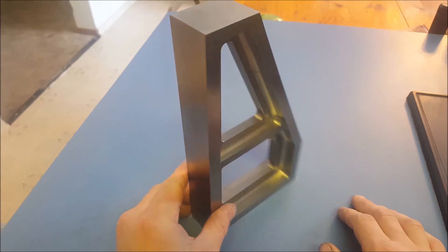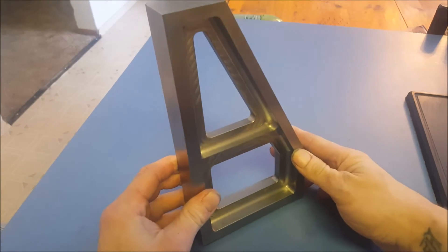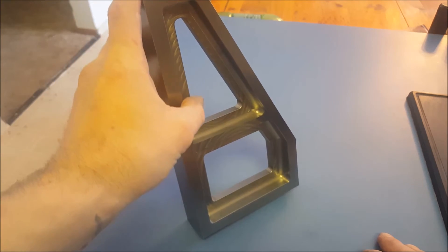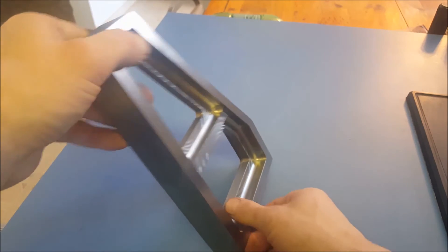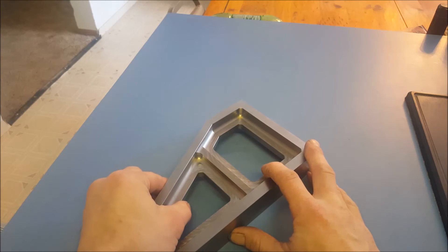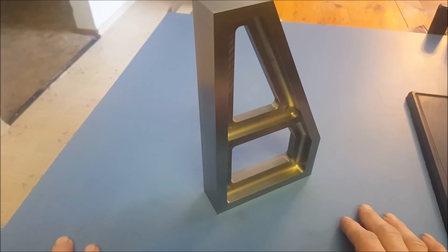I don't know, I might change my mind later. The machining turned out really well. I actually brought it to work with me to try the clean cycle on the oven to do a quick down and dirty heat treat stress relief on it. It moved significantly after all that machining was done. There's quite a bit of material removed out of there. And when I went to grind in this front face and the bottom face, I clamped it to a cube in this fashion and it actually lifted these previously ground faces off the plate. It'll get heat treated — hopefully this works.